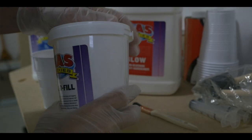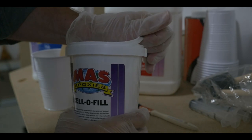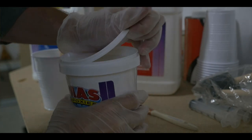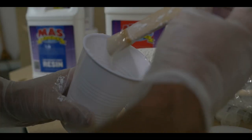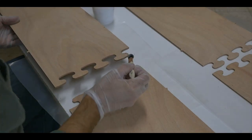For the joints we're going to add some silica — it's basically a silica powder to thicken the epoxy up. You want the consistency to be kind of like a thin mustard.